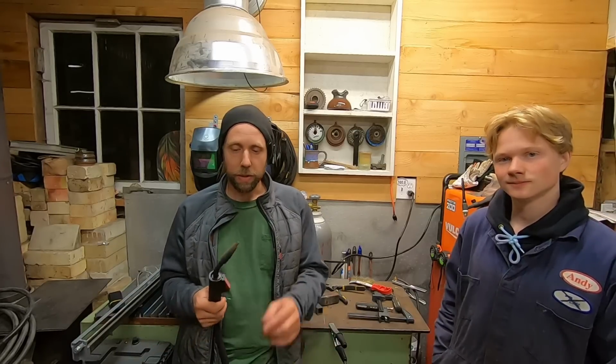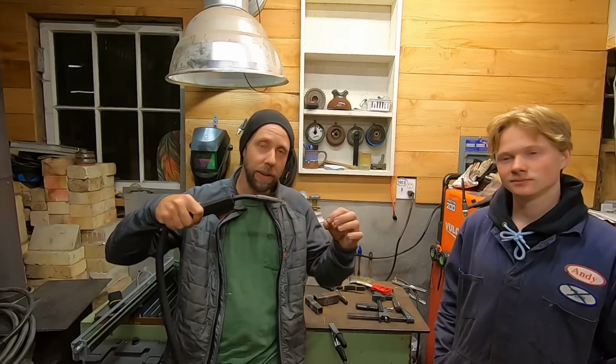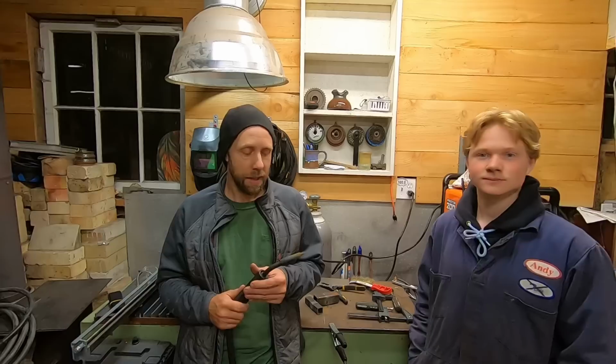And like I said earlier, sometimes we'll get buildup on the tip, and sometimes you'll be welding, you'll see that buildup come right down the wire and get in the weld. That will cause contamination. Little pockets and pinholes, that's porosity. You don't want to really have that in it as much as you possibly can avoid it. It just makes the weld a little more weak, things like that.